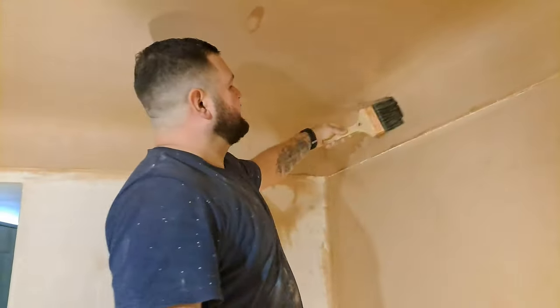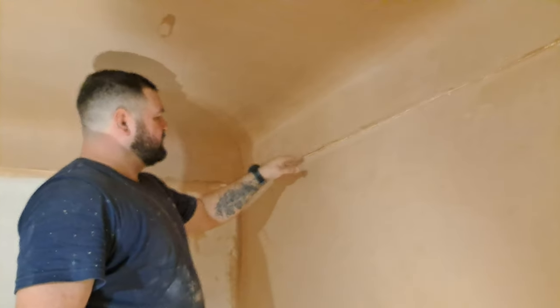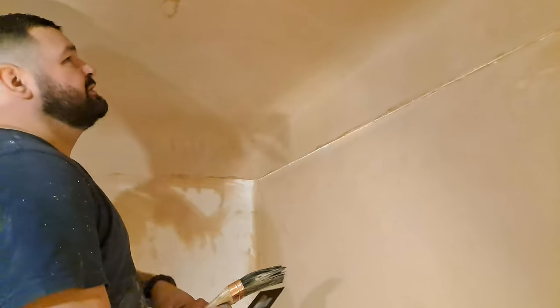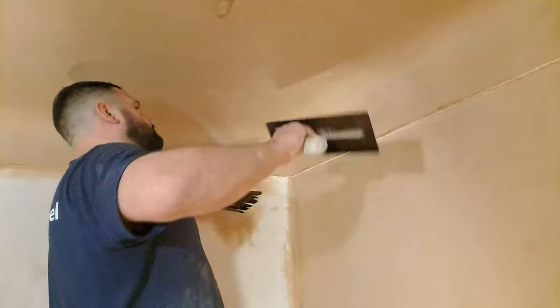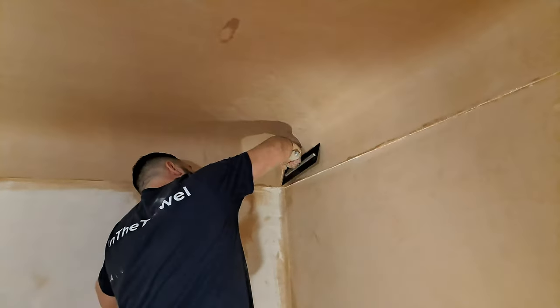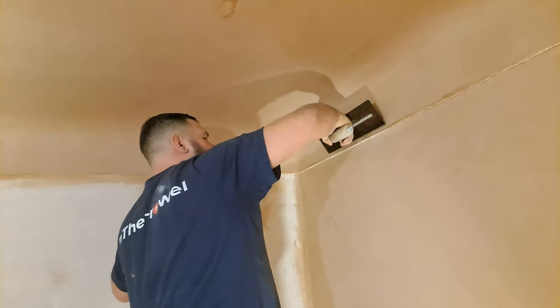Okay, just brushing this now, because this is the second wet trowel. And you can see, starting to get dark patches around the edges where it's feathered in. That's because it's on so thin. It's starting to set in those areas, and obviously there's been like a bump in the old seals. So you know you're getting close to the end now, because you're getting little bits setting. I'll give this the second wet. Again, I'm just setting slightly out the corners. I'm going to use the same process again.